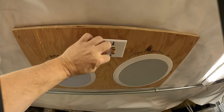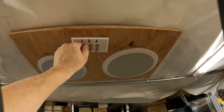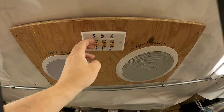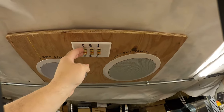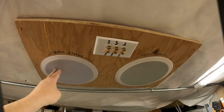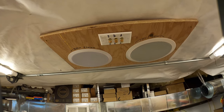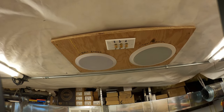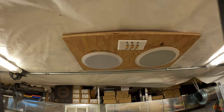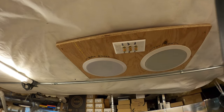Make sure you have a multimeter because a lot of these old homes will daisy chain the speakers. You'll have a left and right input, and it'll go to a volume control, then jump out to another volume control and another. You'll get a really funky ohm load that maybe your amp can't handle. You can get one and even half ohm loads, and a lot of amps can't do one or two ohms. Four ohms is usually the minimum.